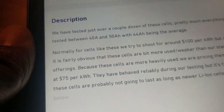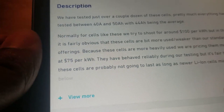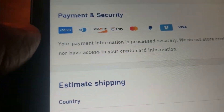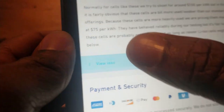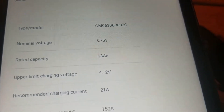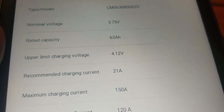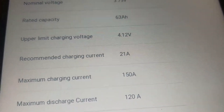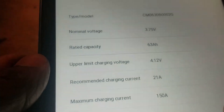My main point is I want to take this battery and test it. I don't have the equipment to measure amp hours directly, but I want to know how long it lasts if I discharge it using my heater. The batteries are currently sitting at around 3.2 to 3.66 volts. I can't fully charge them right now, so I'll start the test at around 3.2 to 3.6 volts and hopefully discharge down to about 2.9 volts.